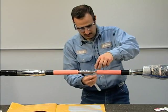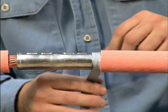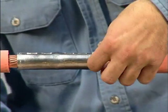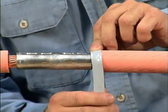The kit contains two packages of high permittivity mastic pads. Using gray mastic strips from package A1, fill the gaps between the connector and the cable insulation. Use two strips of mastic at each end of the connector.